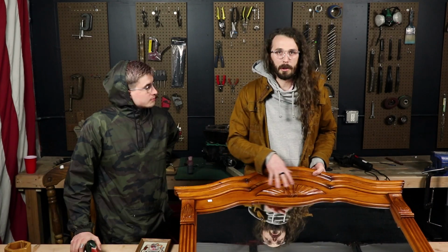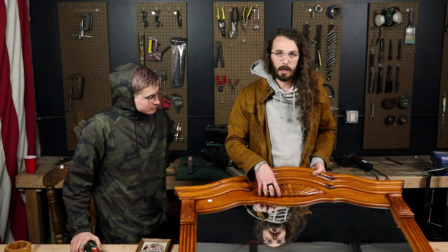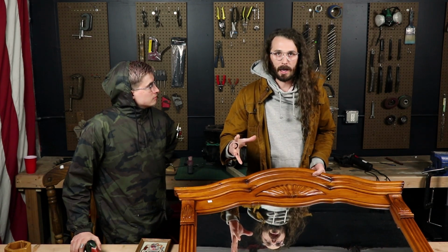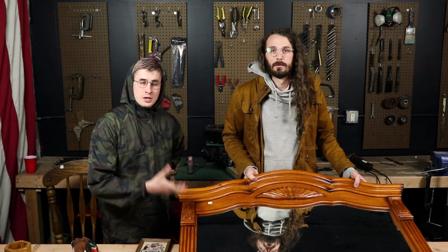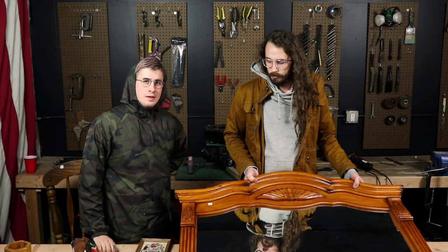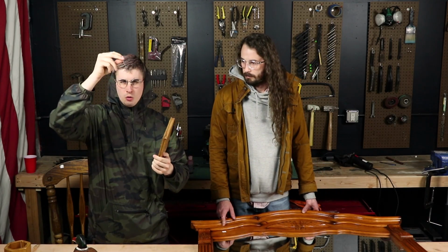One thing to watch out for when you're burning things with really high detailed pieces like this one, where it's got this piece that's probably glued on or nailed on, is to not heat it too high, because that heat can cause the wood to expand and it'll crack the wood and it'll ruin your piece. You don't know if it has a finish on it, so you're gonna want to wear a mask to protect your lungs, or have a lot of ventilation, because you don't know what they put on top. So safety pro tip.